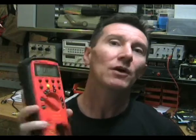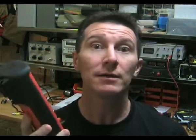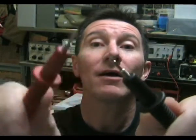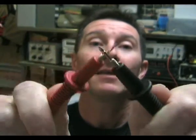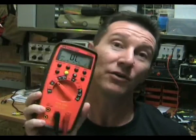One of the things I always check before buying a meter is whether it has a good continuity test function — it's got to have a really fast response. I've got it on continuity mode here and I'll probe on the bench, and you can see that I touch them and it misses completely. If I hold it down you can hear that. So as you can see the response is quite slow — this isn't a very good continuity mode.